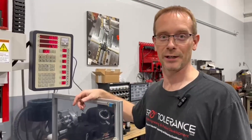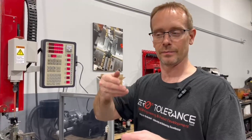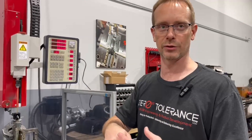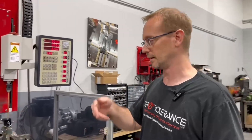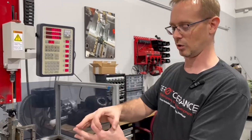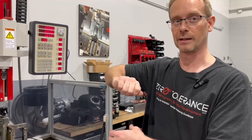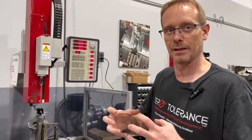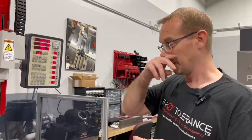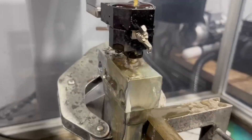This has been burning for quite a while, and I don't know how much more time we're going to spend on it. The conclusion I've come up with is that the solid body of that drill is not going to split in two like I thought it would. If we could burn the spiral out of the drill, we could get it out in two pieces potentially, but that's not going to be the case here. So my thought is: I can burn basically three spots a certain depth, stick a screwdriver in there, and try to break it free — maybe I can get it out that way if it's not really jammed at the bottom. I'm hoping it just got hot, seized up, and expanded into the hole — that's what broke it. So we're going to go to the middle, stop it in a minute, and try to take it out with a screwdriver.